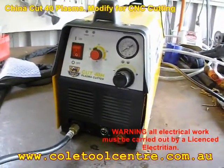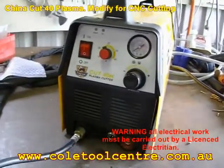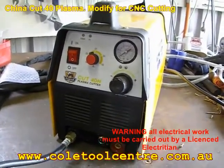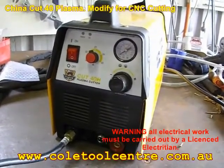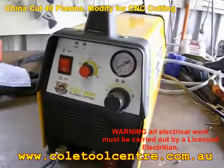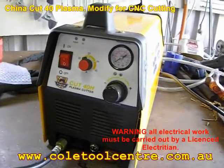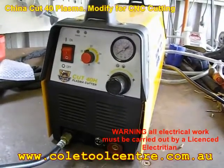Which means it's looking for a voltage. When you hook your two pins here — the ones that turn the machine on and off — to your SmartCut CNC machine, it won't start. What we found was, if the SmartCut CNC machine is sitting on the same earth as your cut table, there's a feedback coming back through the machine, which causes the plasma not to start.